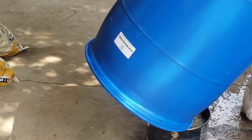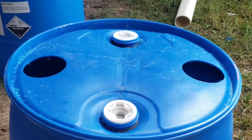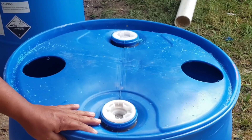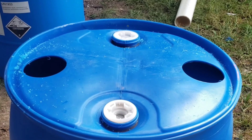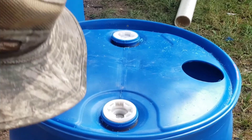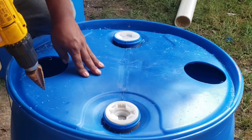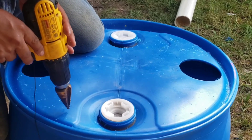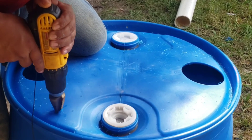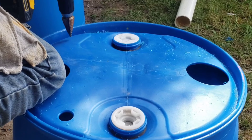In my case I've got a 120-foot leach field I'm doing. I have 21 barrels divided by two — that's 42 pieces. I'm going to do half of each section with three holes. This is the end of the hole, and the first barrel is already down there. This is the last one. I'm going to make two straight holes right here, then do the other one.